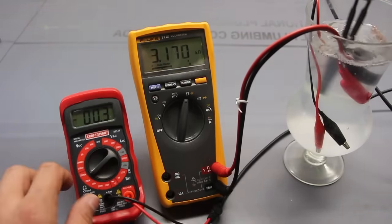Alright, so on this particular multimeter, it has a 9 volt and a 1.5 volt measurement option. And I'm really quite curious to see if that reading is going to be any different than if I just go to my DC and measure it that way. Basically what I'm trying to see is if there is a load. If they put a couple resistors in line and series to test whether, because you can have a high voltage battery that appears to be high voltage, but as soon as you pull current from it, as soon as you try and load it, it fails.